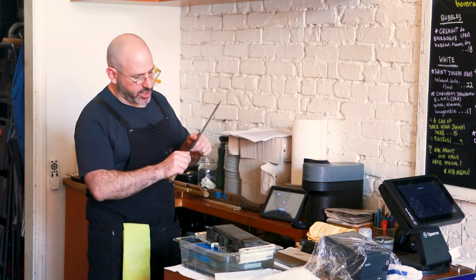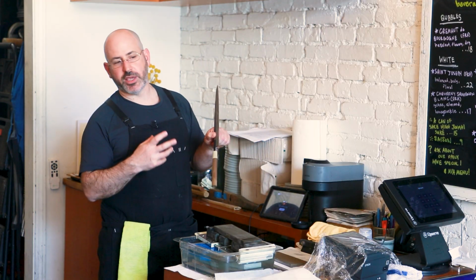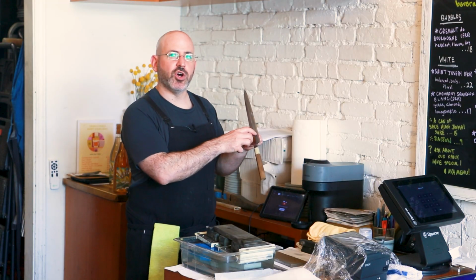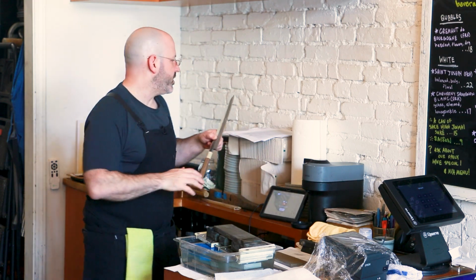You can see also here, there's a misty steel and then a shinier steel at the edge. That's because this knife is made out of two different kinds of steel, and they are clad knives. There are some knives that are made out of solid pieces of steel, and they are called honyaki knives, but most knives will be clad like this, and the intersection where they come together is called the lamination line. If it's a solid steel knife, it will have a misty, wavy line closer to the top, and that is called a hamon, and it's usually got a wave pattern with it.